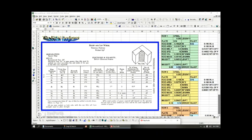And I only get that if I take this previous value and I multiply it by 12 divided by the rod melt speed, because it's 9.5 inches per minute. So you have to ratio it up to 12 inches per minute to try to get the same values in feet. And then row 2, I had to do the same thing. I was able to get to 14.